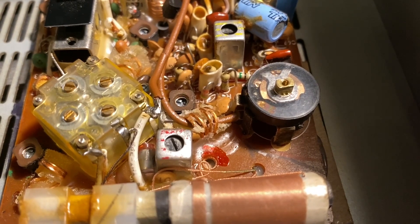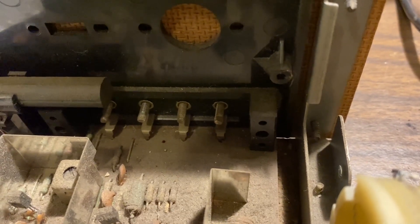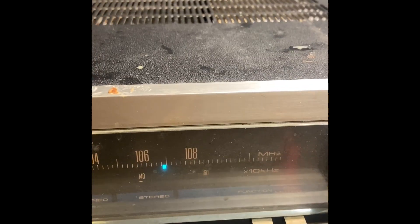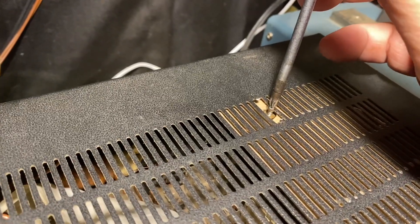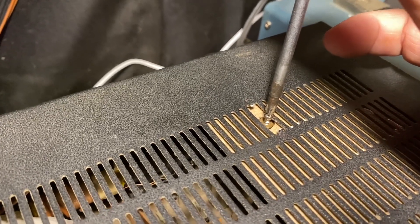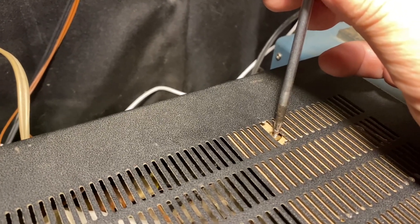I took a piece of insulated wire and found the can — look for the can with the red screw, which in this case had red paint very close to the tuning capacitor. Right next to that can there's a little coil. I simply ran the wire right down the middle of that coil — it just goes through there a little bit and stops. That wire comes out and lands on the far left lug, which is the AM external antenna connection. When I hot glued the AM/FM radio inside the lid I notched out a spot to access the tuning capacitor, and as you can see, as I turn the screwdriver, you've got a homemade BFO.